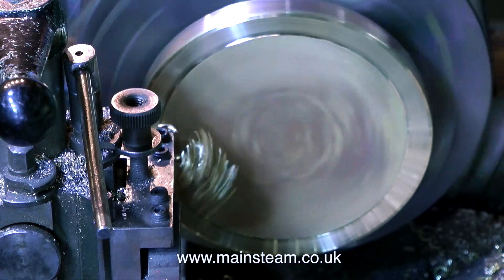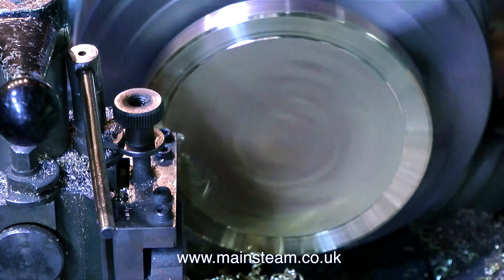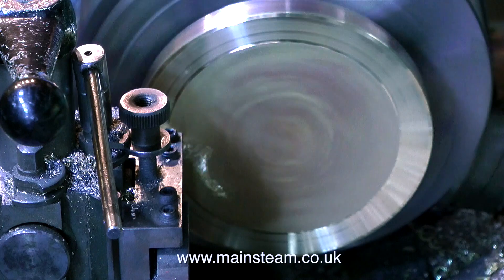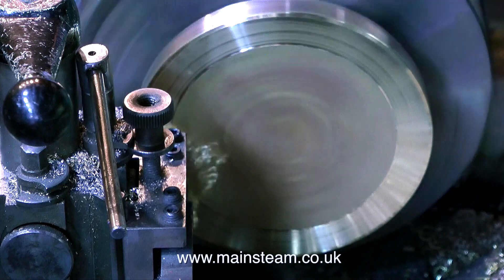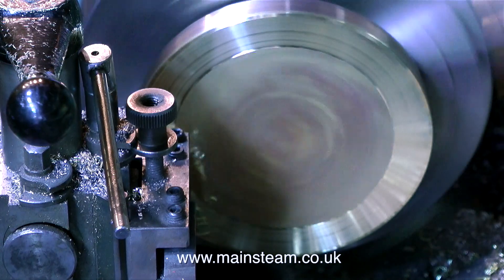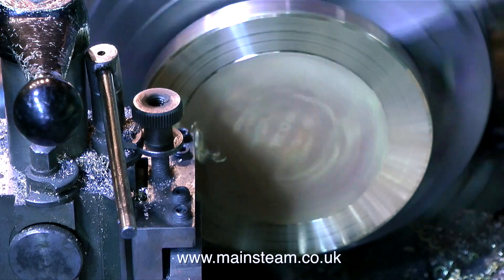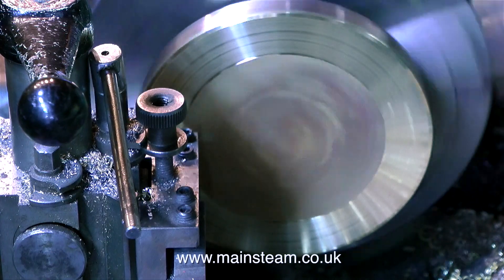This top cap is not a very heavy duty item. Its main function is to support the chimney, and there will be a superheater built into the base of the chimney to collect the hot gases and persuade them to go up the chimney. This boiler is heavy to start with, so I do not want to add any unnecessary weight, particularly if it's going to be used in a model marine application. I'm machining away some of the 3mm brass — I used 3mm in the first place so it wouldn't warp and distort during the silver soldering process.